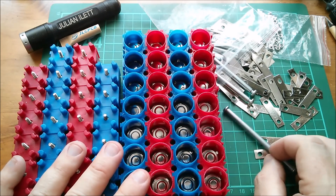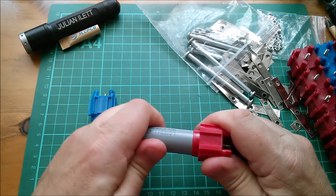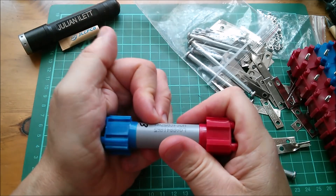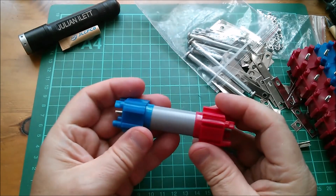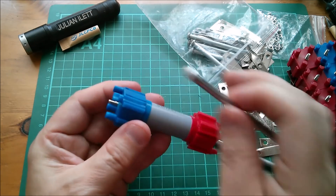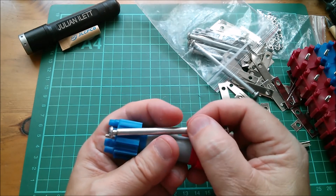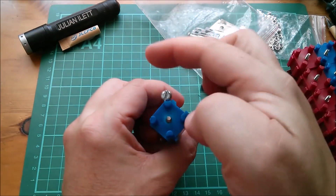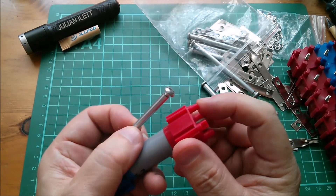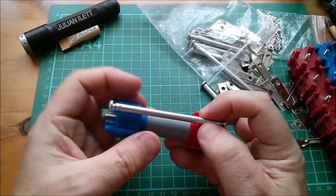Let me explain how important the barrel bolt is. The end caps push onto your cell — it's quite tight and varies depending on the diameter of the cell and the thickness of the wrapping plastic. To some extent they hold themselves on, but over time they just slip off. The barrel bolts are designed to hold the two ends together. The bolt actually goes in the corner, sitting on the little shelves on these standoffs. The standoffs are designed so you can put the battery pack down and it's not resting on its metalwork. The barrel bolts hold the pack together.